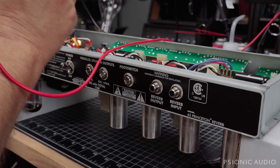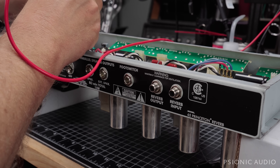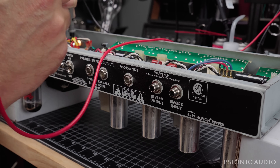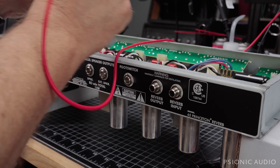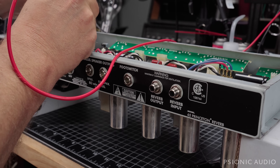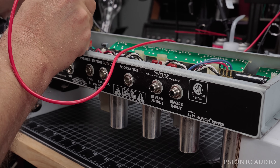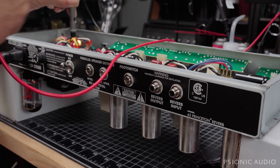Negative 41.3. Negative 41.3 — that's with 120 volts coming out of the wall. So there's no leakage from the preceding stage, at least at initial power-up. The unloaded B+ is 472.5 volts. These are 500-volt caps.